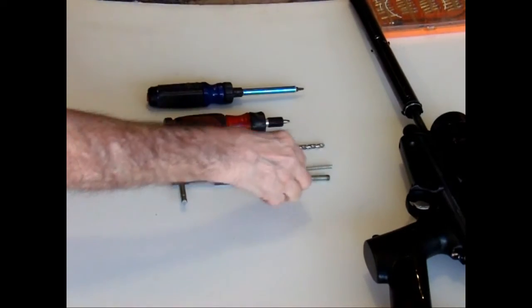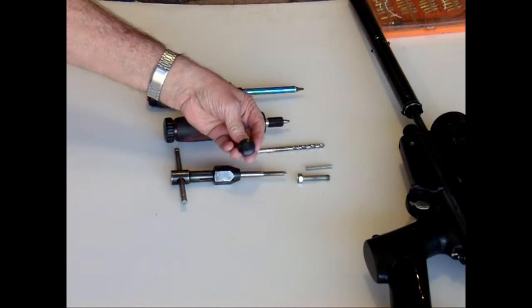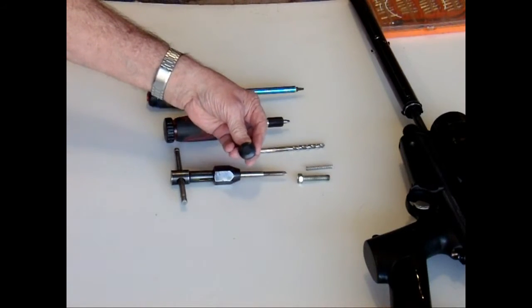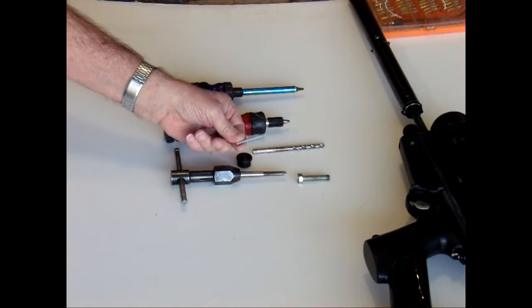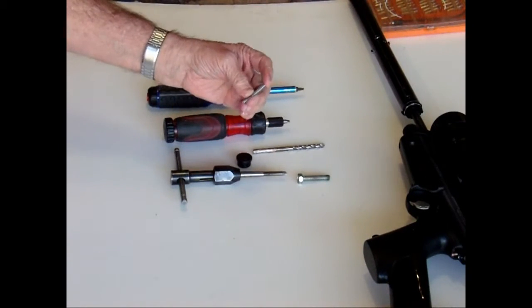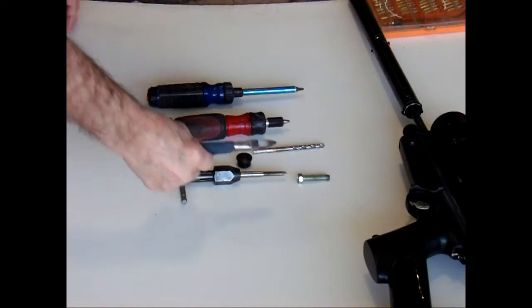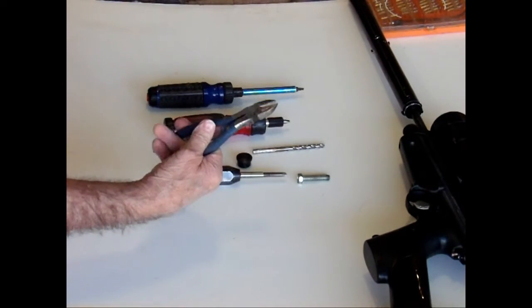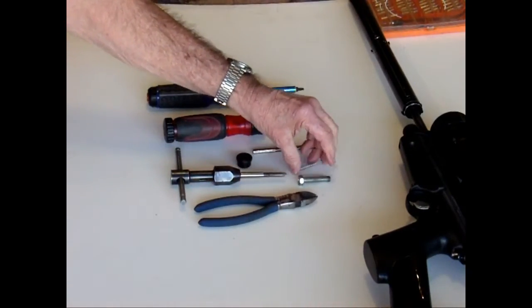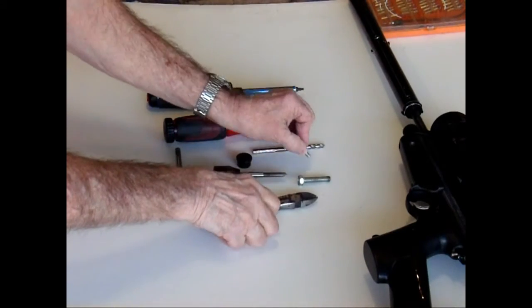as the tap. You're going to need the tube plug from the end of the large tube on the air gun, and you're going to need the spring that comes out of it. This is the hammer spring. And you're going to need a pair of cutters to cut a couple coils off of the spring, which you're going to be doing later.